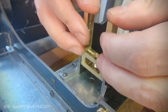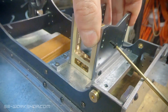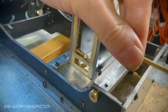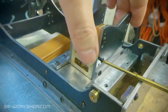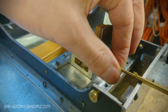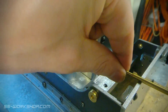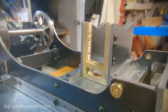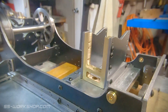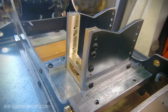And with the magic of video it's all cleaned up and ready to go. The block can then be screwed into place, which completes the first part of this assembly. The next part to make will be the inside cylindrical bearing and the axle boxes, but they'll have to wait for the next episode. I still need to clean up the bored faces and I have a brass tube to fit through those holes at the bottom, but that'll have to wait for another day.